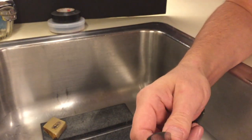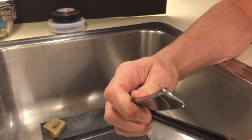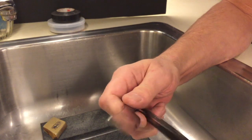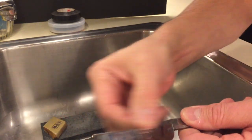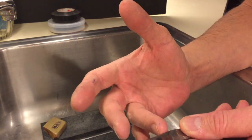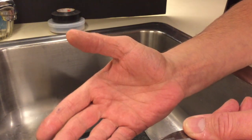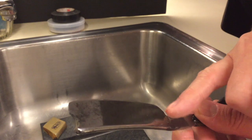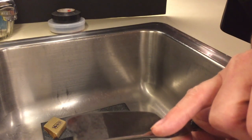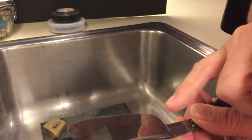There's almost no gap in there. It's that heavy, so it's like a 1/16 hollow. There's a little tiny grind, but to hone this, I'm not concerned about wearing anything over here on the spine because there is nothing there, and I'm not concerned about putting a flat on it because I don't care about that. But I do want to not have a ginormous bevel.